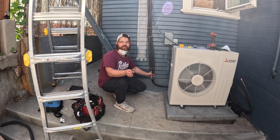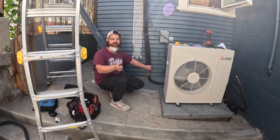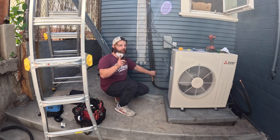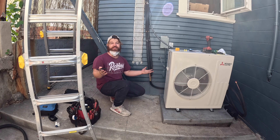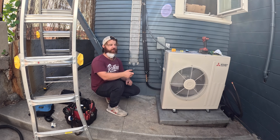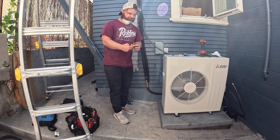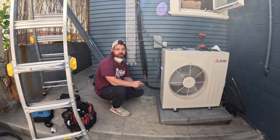If you're a homeowner installing your own system, this is a great alternative to brazing. If you're a contractor wondering if these work — we've never had one leak except one time because we didn't get the pipe all the way in. The only failure we've ever had was one time due to our own user error. You should definitely get the support kit because they don't always shove in as far as you think — sometimes you really have to push hard, other times they slide in easily.